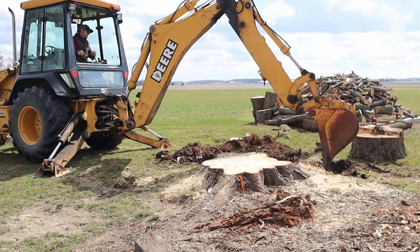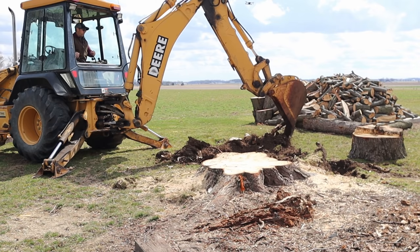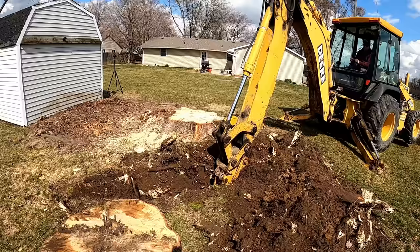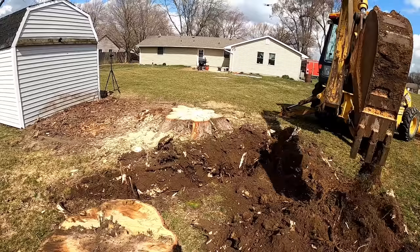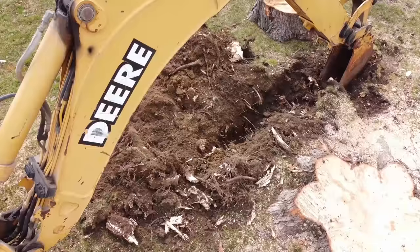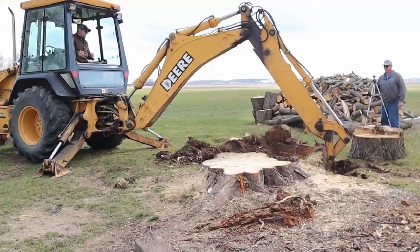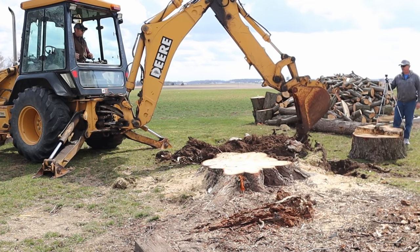You know, you get going on this and you think, 'Oh, I'm gonna take my time and go easy on the backhoe,' and then you start looking at your watch and think, 'This is taking so long. Maybe we should have ground this out.' The problem with grinding this stump out is it's going to be right on the corner of a new barn. Whenever you grind a stump, you never get all the wood that's below the surface. I will get a lot more of it than a stump grinder can get, and you don't feel like you've got that cavity underneath that's rotted out. Usually for me, the practice is to get the stump out, dig down to some good clay, some good solid subsoil, and then build on top of that.